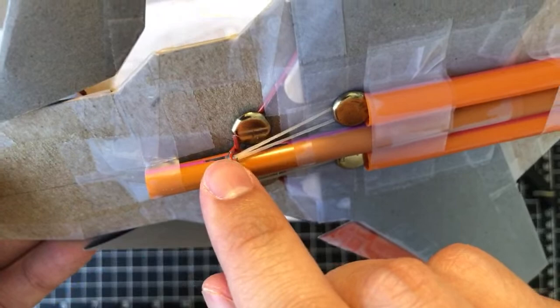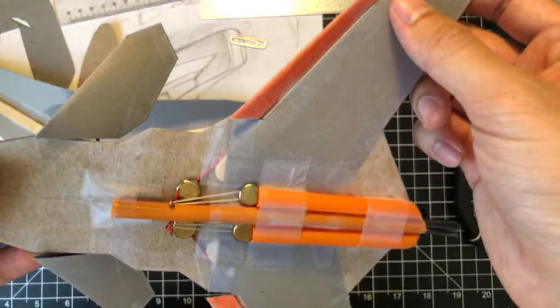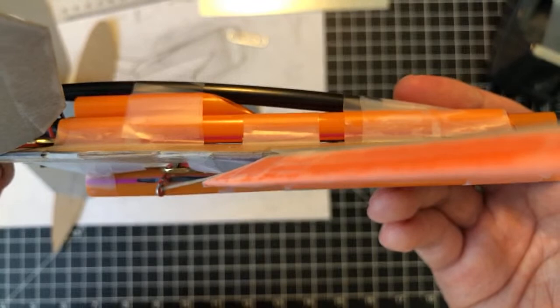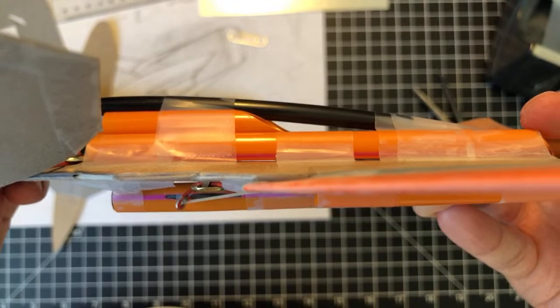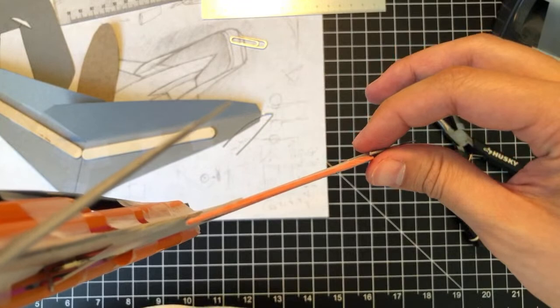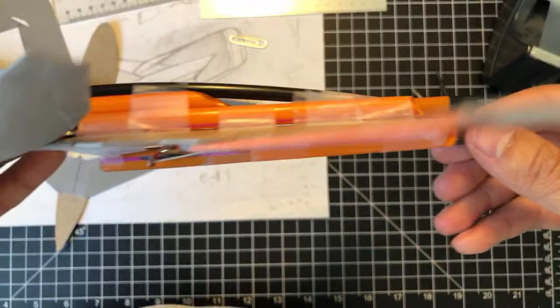So the slats out here, which are connected via a rod, want to actuate down, right? And what we're doing is, if we go against that and push forward, it's going to push that lever forward, which is going to push the slats up, right? And so if we demonstrate that here, if we push forward, the slats kind of retract into flight mode, right? So this isn't perfect. This is a prototype. Ideally, this would be perfectly straight, but maybe in a future version with better manufacturing we'll be able to fix that. But for now, I think this is a nice proof of concept. So if you pull the rod pin back, it's going to deploy the slats.